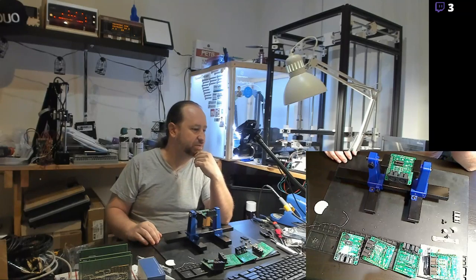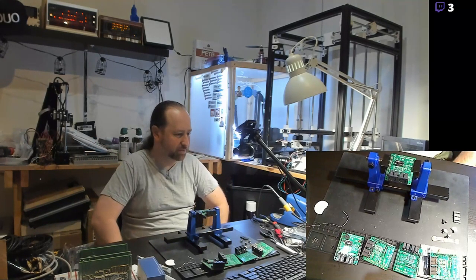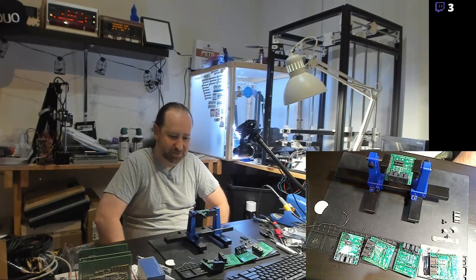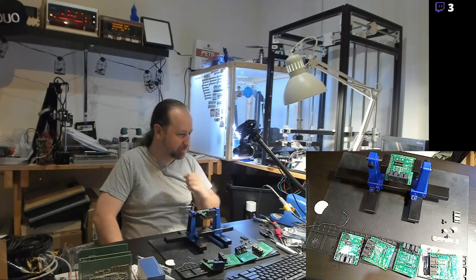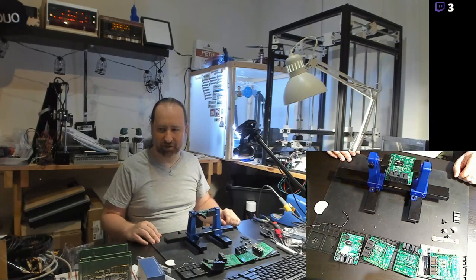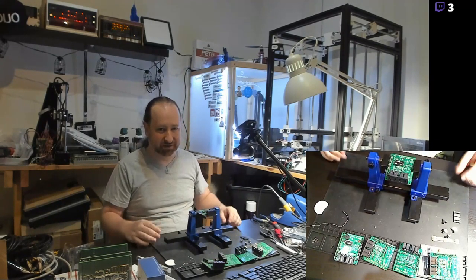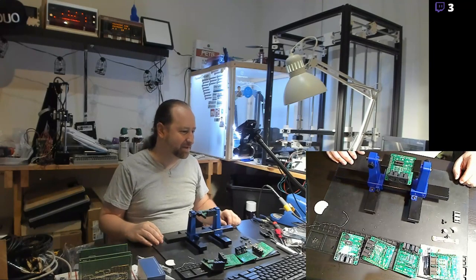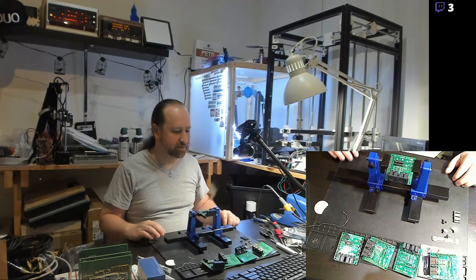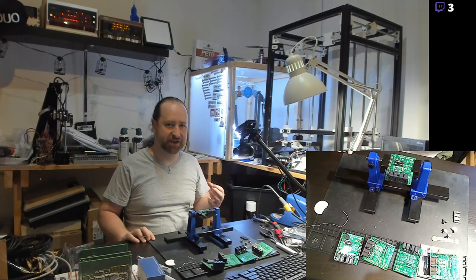I have Marlin 2 on my Gen L running 2.85 millimeter direct drive Ender 2 mod. That's the one that you were playing with recently, where you threw in that full on direct drive on that Ender 2, and gosh, that thing goes massive on that cantilevered arm. But hey, it prints, right? And it prints with 3 millimeter filament. You probably crank out some pretty large prints within the 200 by 200 bed on that Ender. Does that Ender 2 mod have a Volcano, or is that just a regular E3D V6 with a fat nozzle?